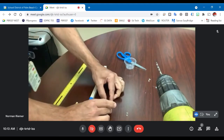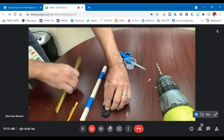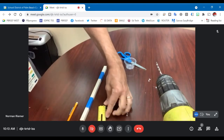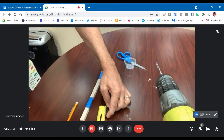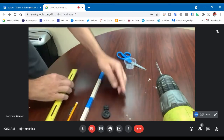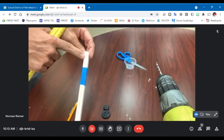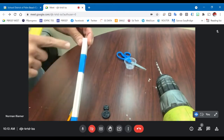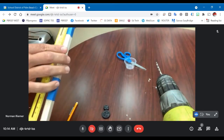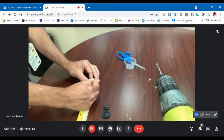I'm going to put the gears together and bring my ruler in to measure in centimeters. From the center of one hole to the center of the other, it looks to be about 2.6 centimeters. So I've made my first mark two centimeters from the end — this is the back of the frame. The gears are going to be 2.6 centimeters apart from center to center, so I need to measure 2.6 centimeters away from that mark to make the third hole.